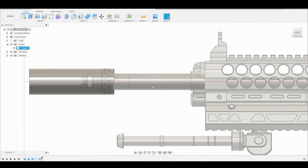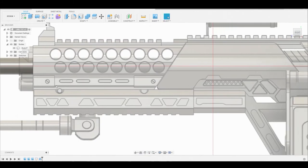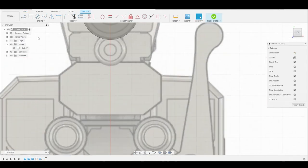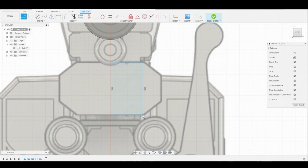Let's hit okay to finalize that. Now I want to go back to the front view so we can start getting some more of these blackouts. So let's go to create sketch, select the plane or the 2D background to begin. Let's use our two point rectangle - we're only doing one half of the model, so don't worry about the left side right now. From the center line to this bottom corner here, now we're going to switch to the line tool and just follow this reference.